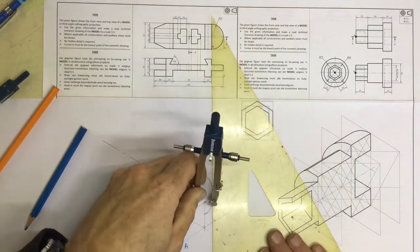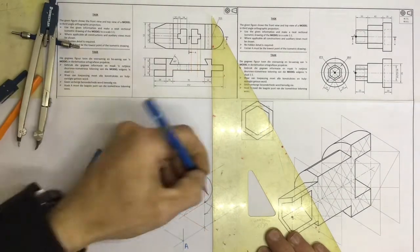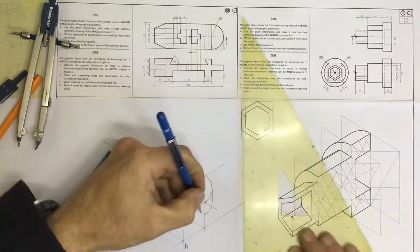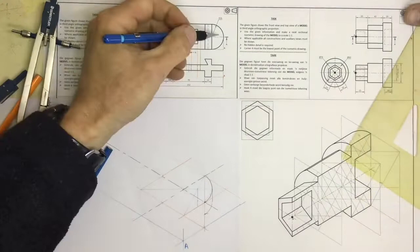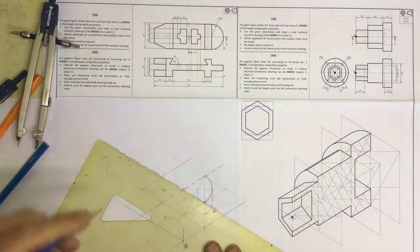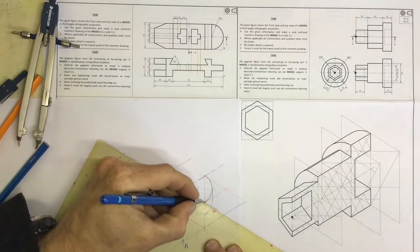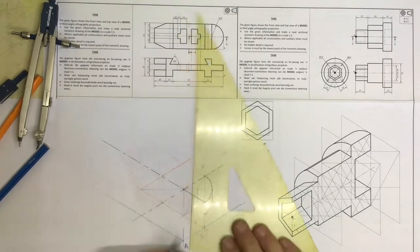That arc is not a full arc all the way around. It is going to go up to where there's a tangent to this top circle over here, and I can drop a line coming down. There's that small little arc over there, and then it says that I get cut all the way across to that point over there. So I can draw in a nice dark line coming across there. It's going to drop a construction line down.